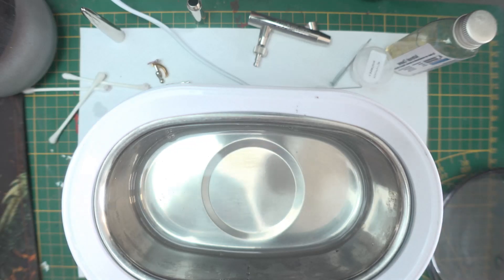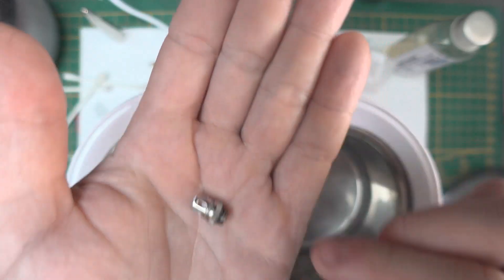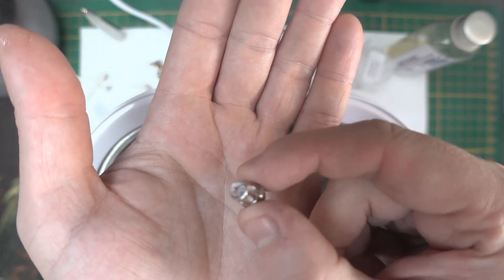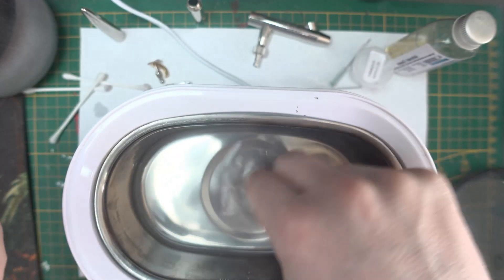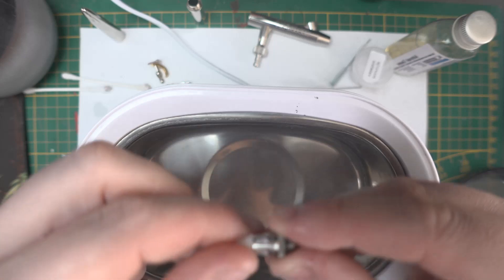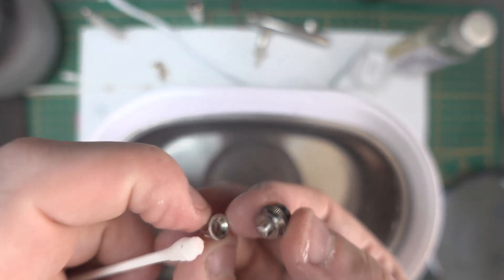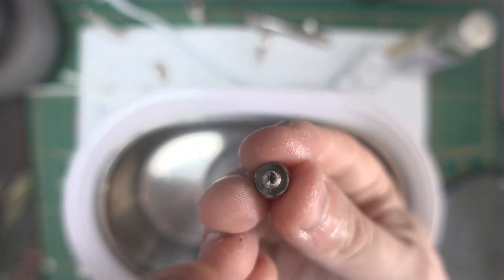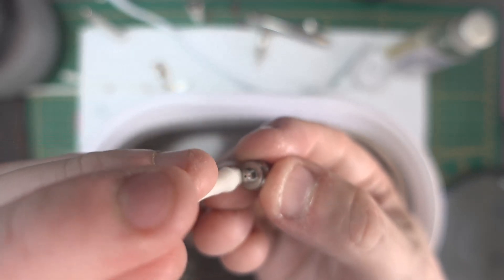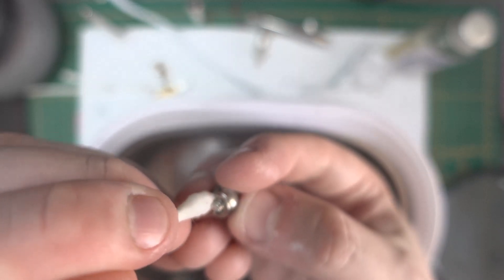Good — all the big parts are now done. The nozzle — I have it here as a whole. A common mistake is that people think they have cleaned it completely when they only clean the outside. You can see it is already moving and turning. Look, it can come off. And then you see here — there is a lot of paint inside. That is what you want to remove. This must shine nicely — no paint near it at all.